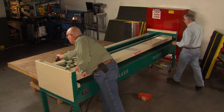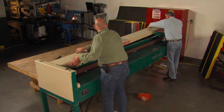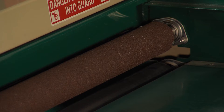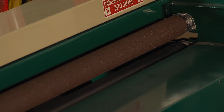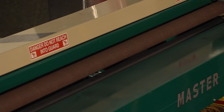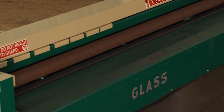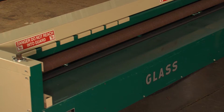The feed rollers control the entire grooving process. It is absolutely imperative that the feed rollers on the machine be kept in shape on both the input side and the output side. The older machines did not have this emery cloth roller wrap on the feed rollers. The grit tended to wear so that the first four or five feet of the roller would be completely bare or smooth. When this happens, the board moves through the machine more rapidly at the far end than at the drive end, making a finished duct with a twist, and closure and installation problems will then occur in the field.